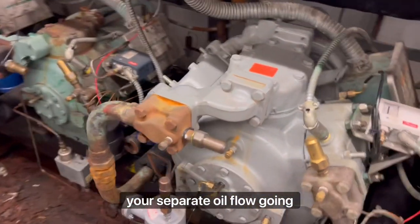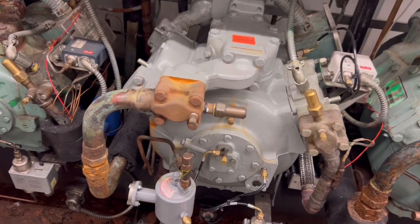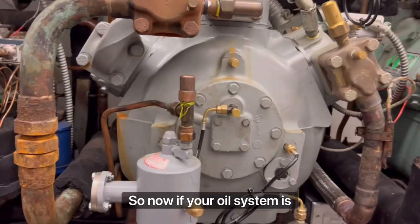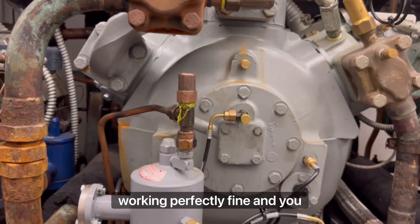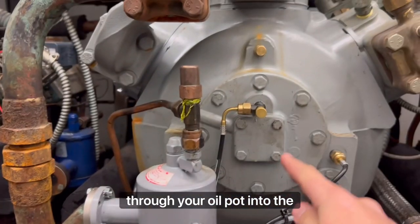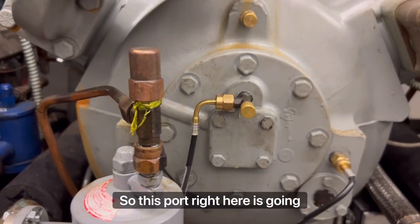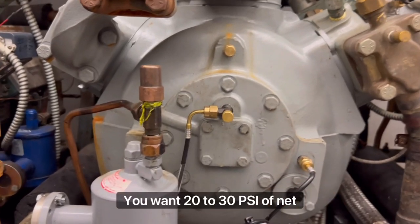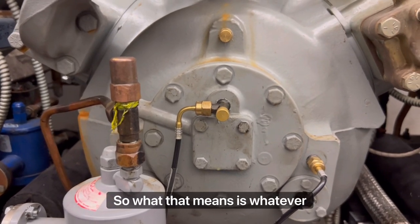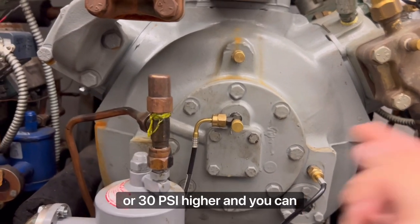So if all that is working and you still don't have proper oil flow going into your compressor, then you can look into your oil pot as the absolute last thing. If your oil system is working perfectly fine and you get to your oil pot and you have proper pressure going through the oil pot into the compressor, you want to check your oil pump. This port right here is going to be the port for your oil pump on your compressor. You want 20 to 30 PSI of net oil pressure on your compressor — meaning whatever your suction pressure is, you want your oil pressure to be 20 to 30 PSI higher. You can check that right here.